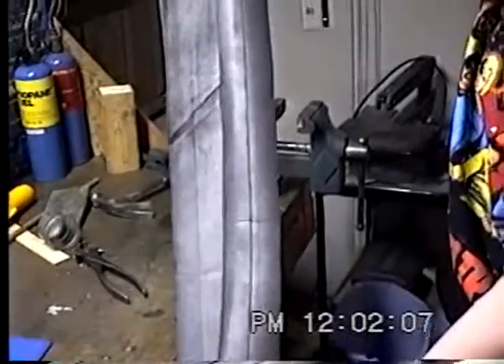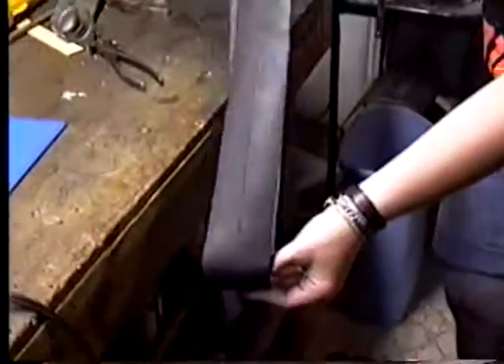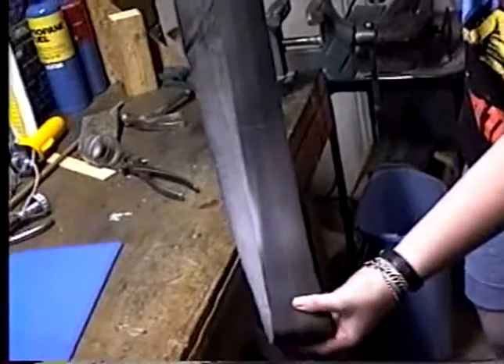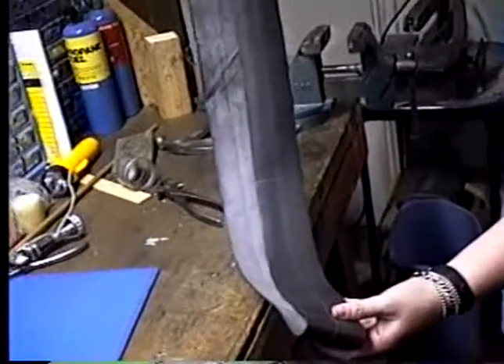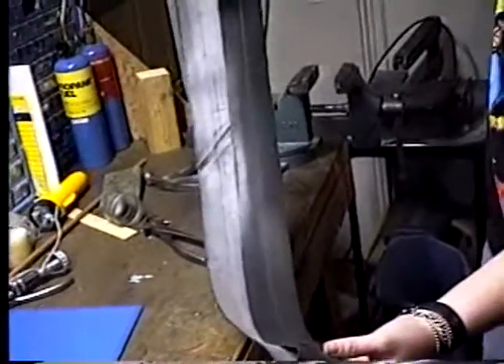One final note which we forgot to tell you — this was our original belt. It was a rubber belt; we had cut it out of an inner tube. It wasn't working — we could actually draw an arc off the rubber itself; it was burning. So we figured it might have been slightly conductive, which I guess was from a lot of carbon in the belt itself.